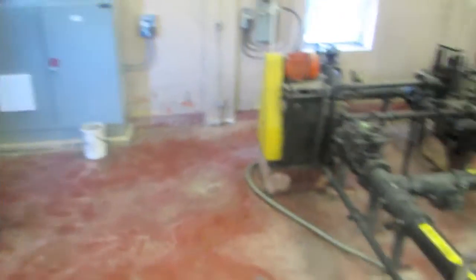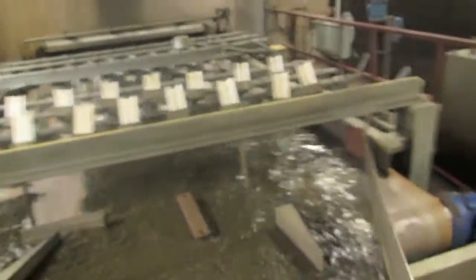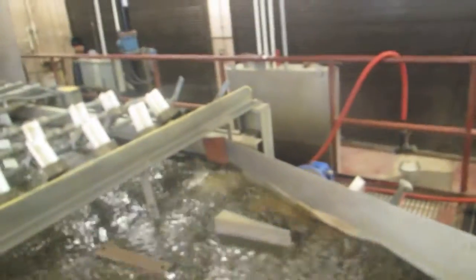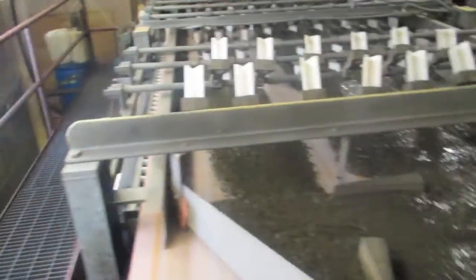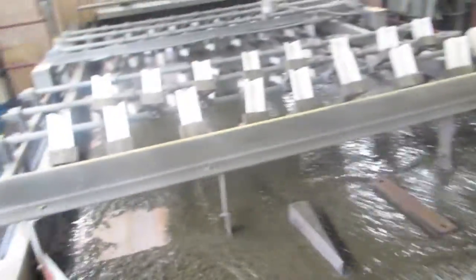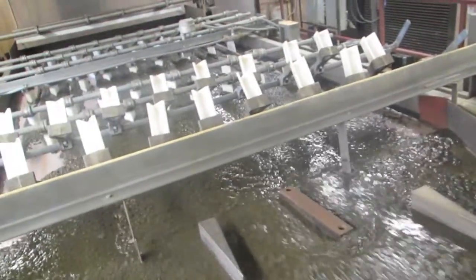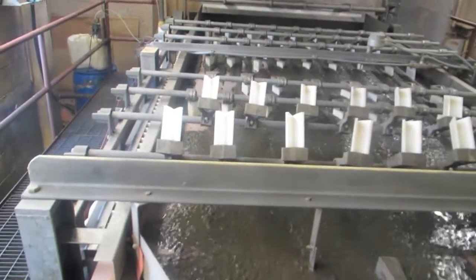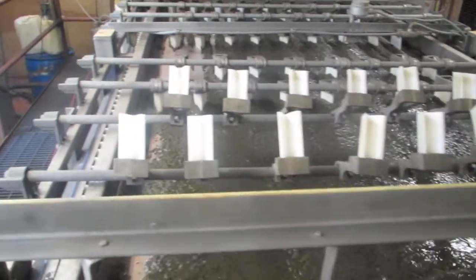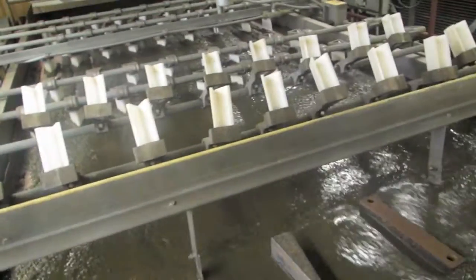Then there's a stick here. You grab this stick and adjust these ears so the flow doesn't go over the edge of the belt. Pull this one up. Now you've got good coverage of sludge throughout the entire belt. The little part on this side, so I open this up a bit more.